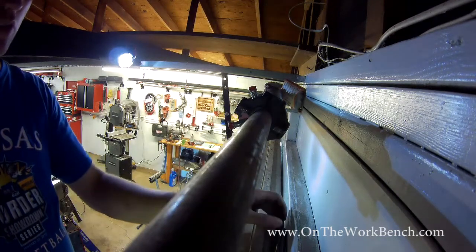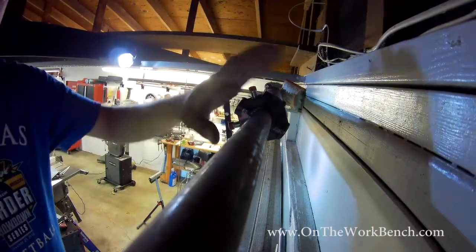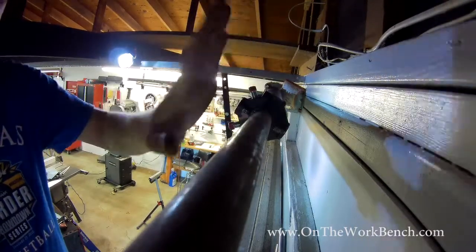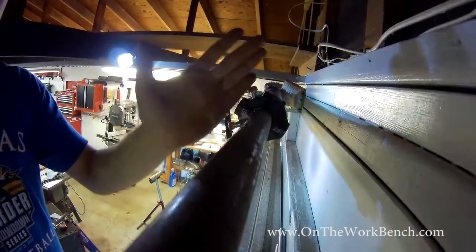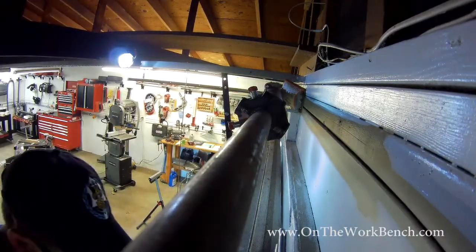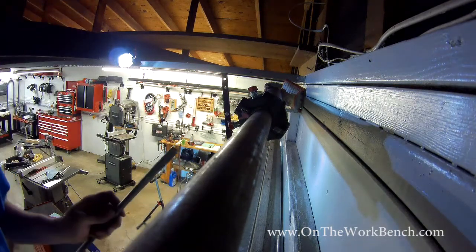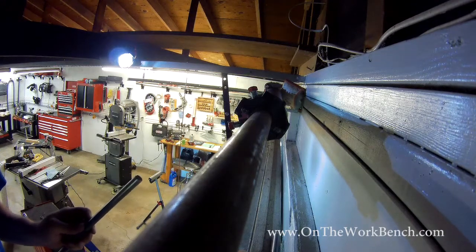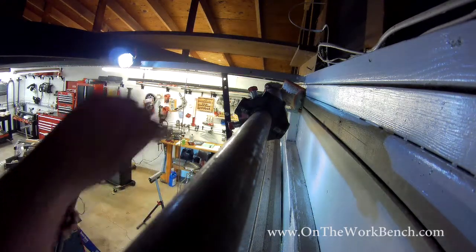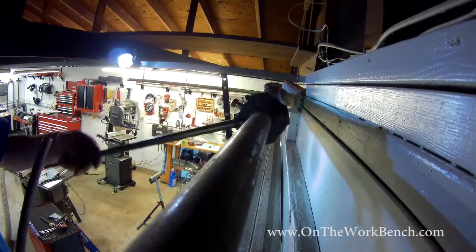So we're going to use our winding rods. We're going to make sure that we're not behind the winding cones here at all. We want to make sure we're away from it and we're reaching into it to put our rods. And so make sure we're back with our ladder and our body placement. And then now, remembering the number of turns that you took off earlier, we're going to go ahead and put that same amount of turns back on. Bear in mind that as we go, the amount of force it's going to take is going to increase. And these are measured in quarter turns.